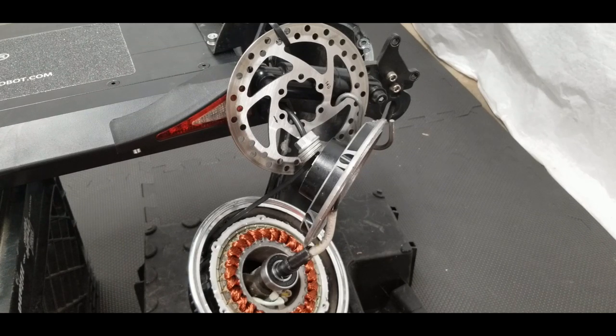First of all, we need to understand a little bit about how a brushed and a brushless DC motor works. It often helps to explain how a brushed DC motor works first, as they were used before in a lot of applications and are still used in some of the cheaper power tools. But mostly things are going towards brushless, because brushless motors run more efficient and cooler. A brushed DC motor has a permanent magnet on the outside of its structure with a spinning armature on the inside. The permanent magnets, which are stationary on the outside, are called the stator — which would be this right here.